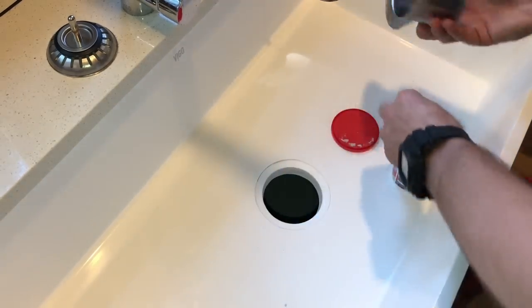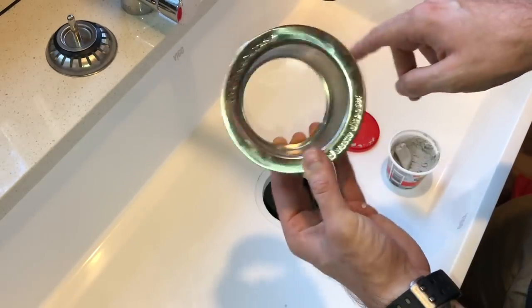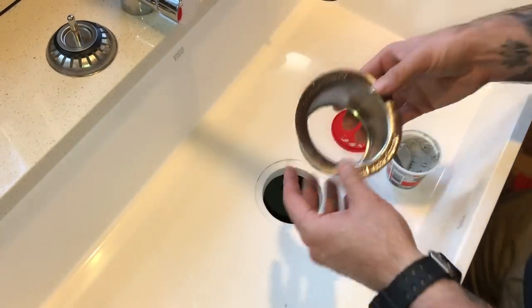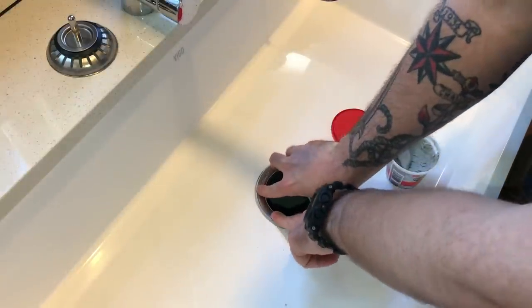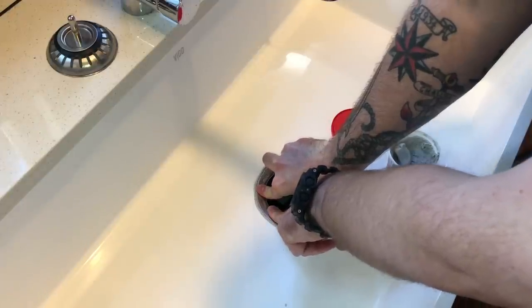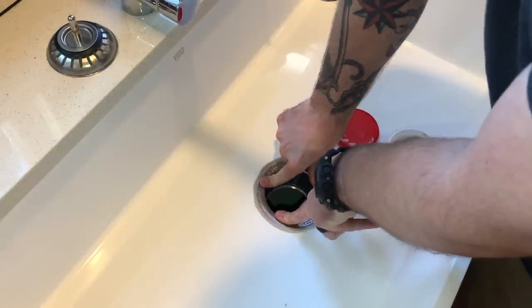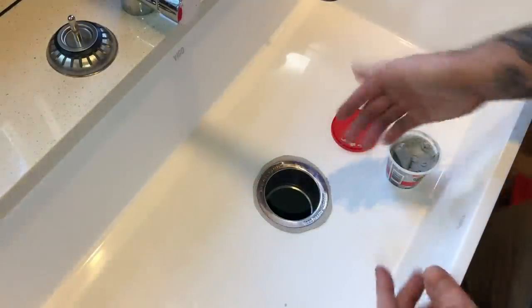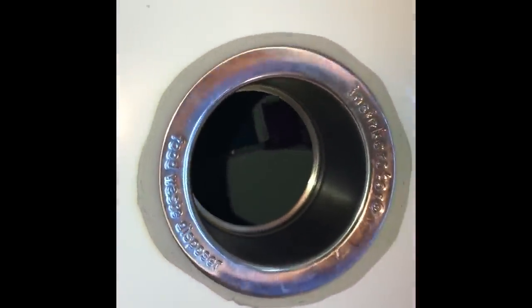Some of the putty works its way into the edge and the rest will smash out around the base of where the flange fits into the sink. If you're a little bit OCD, when you press this in make sure you've got your wording lined up. Get it in place and just press it down to lock it in. This stuff is going to squeeze out - that's completely normal. Get it pressed before you go to the underside of the sink to work on it from the bottom.